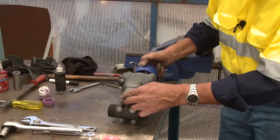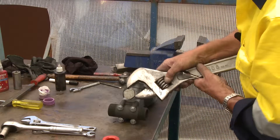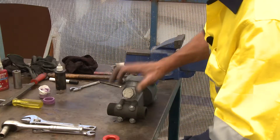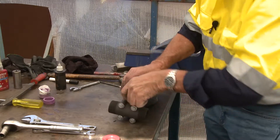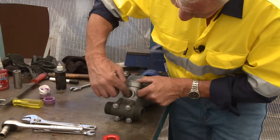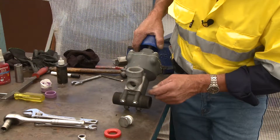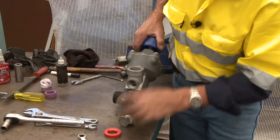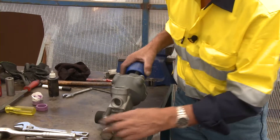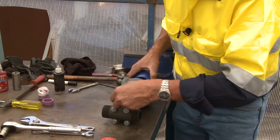If you do have substantial grit coming out of that plug, you'll need a sizeable shifter to undo it. Be careful not to over-tighten because you can actually split this aluminium housing. A little bit of thread tape on it is a good thing, and you can check the thread while you're at it to make sure it's clear and clean. If the grit starts flowing out and you can't get the plug back in, lay the pot backwards so the grit stops flowing — that enables you to get the plug back on. Clear the grit out of the thread and put the plug back on.